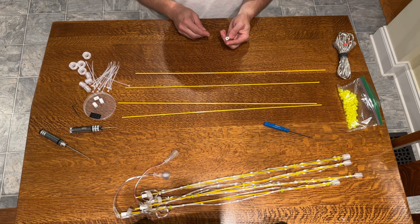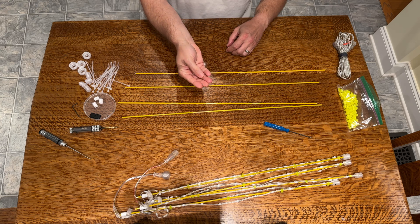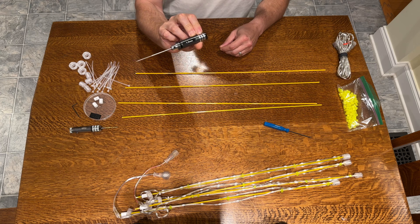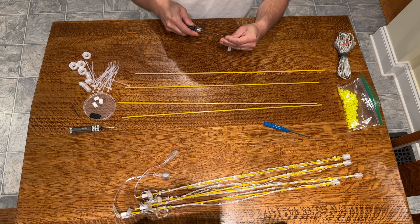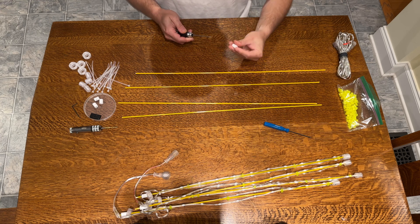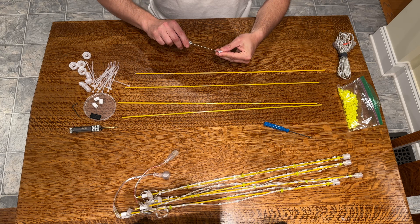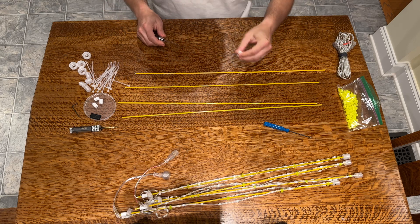The first piece we're going to do is the barrel connectors. You'll want four of them — they're kind of small. They are M3 grub nuts, four millimeters in length. You can use a 1.5mm Allen wrench for these. When you set them into the connector, sometimes these little grub nuts aren't the highest quality. I do not use a tap for these — you get a stronger fit if you just muscle your way through into the barrel connector, and it doesn't take much effort.